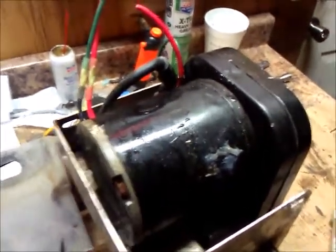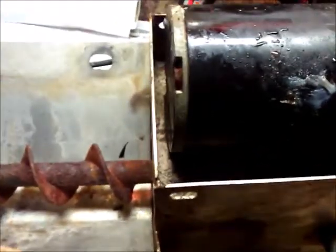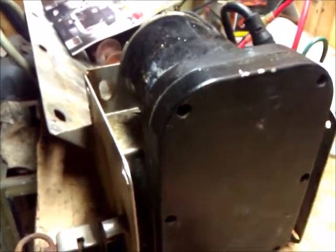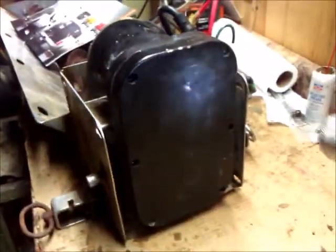What I'm trying to do is either repair or replace just this electric motor, hopefully for close to nothing or very cheap. I've taken this out of the unit so I can work on it on my bench more easily. The first thing I did was take off these Allen bolts right here — they're five millimeter. There are six of them all the way around. You want to be careful with any salt-related stuff because it gets corroded pretty easily. I've got all these bolts out; next I'm going to take this cover off.